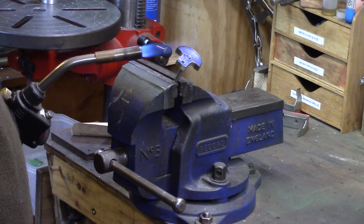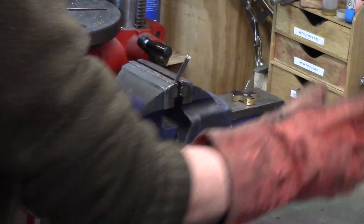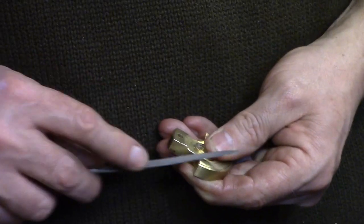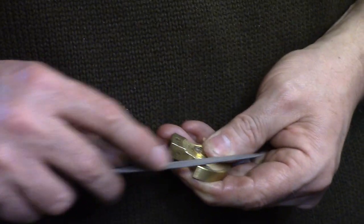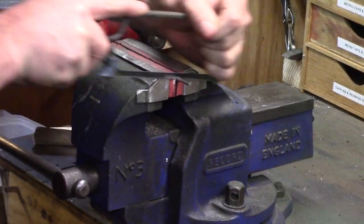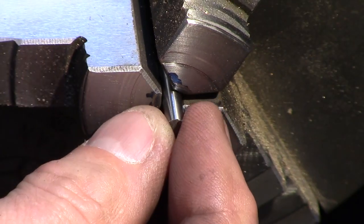The chemical bond was then released using heat and when cooled down the crank disc was tidied up with a small needle file. The crank pin was then sawn to length and the ends cleaned up in the lathe.